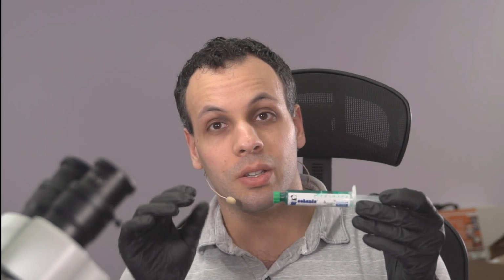Mechanic UVH 900. It's this really cool stuff that it's electrically insulative, and it also keeps something from moving. So I can put that liquid over the wire, and then I use this nice little UV pen, which you shouldn't look at because if you get UV in your eyes, it could be very bad for you. So I just put that in my. Wow, that really messes with the sensor, doesn't it? Damn. Yeah, so I put this on it, and it immediately cures itself, and then I can solder the chip on without worrying that my jumper wires are going to move or short to other jumpers.